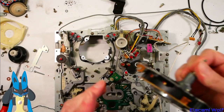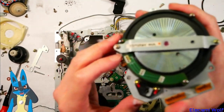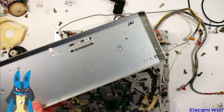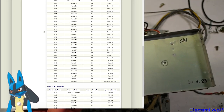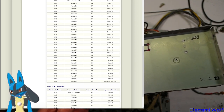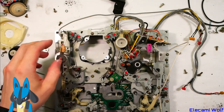That's the mechanism. I was mistaken about the sensing on this — the reason why those two are in series is because those are LEDs. The receivers are on the other side. Because they are separated they're common-collector, and then FG1 and FG2. So the sensing is on the top and it is operating like an incremental encoder. The date on the metal work says 59 4 23, which I believe is a Japanese Showa era date — Showa 59 equals 1984. That correlates with the likely age of this machine.